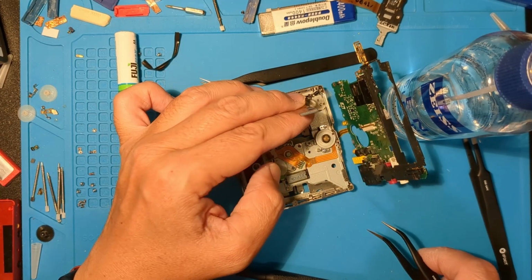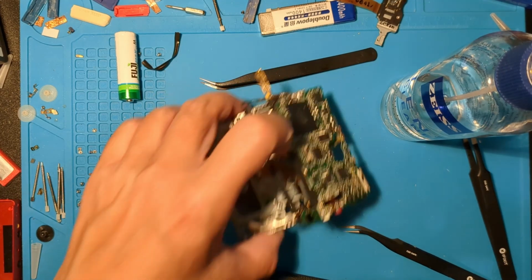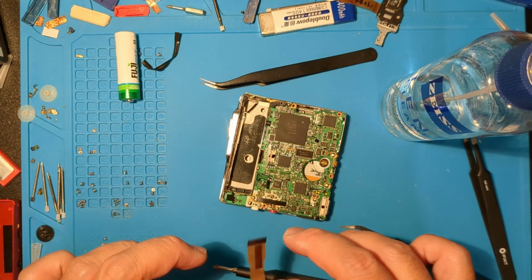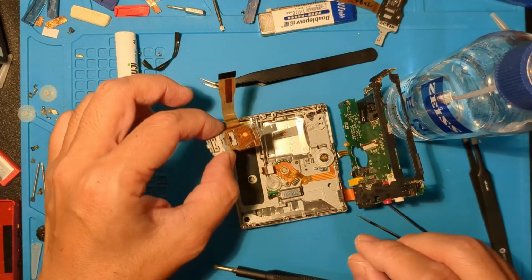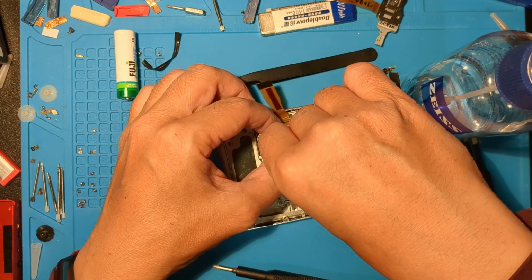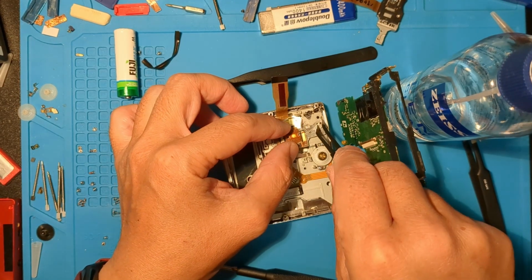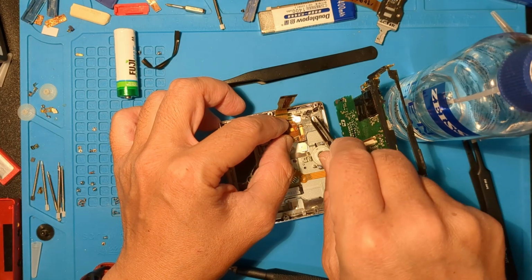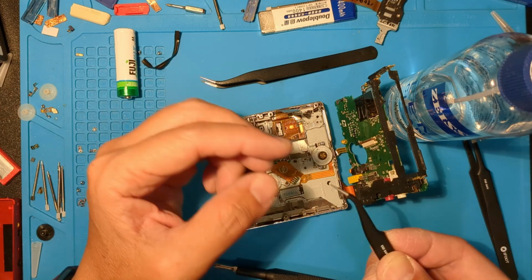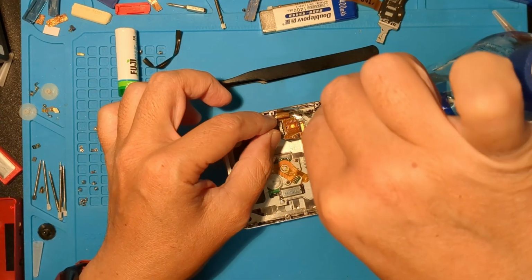And let's slide out the laser sled. We need that in the silver body. Okay, putting it back in the silver body is some extra work I didn't need to do, but here we are. Slide the right head arm back onto the laser sled. And screw it down.